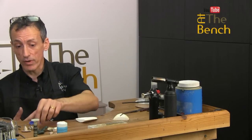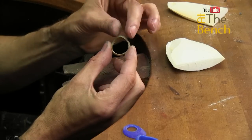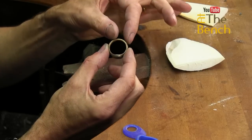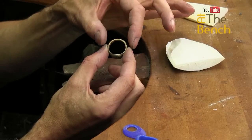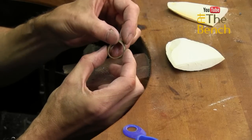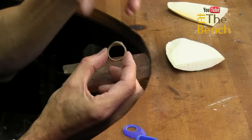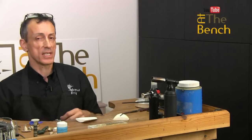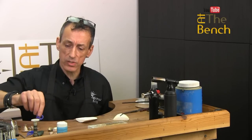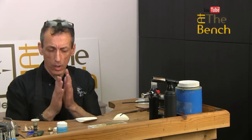In something like this arrowhead, we have the silver coming down from the top — the largest area — and then it fills the smallest area at the bottom. You don't want the silver coming into the narrowest point first. Likewise, if you were making a ring, this is the thickest area — not much point having it this way up trying to get silver down into a thin, narrow area. You would have the sprue and pouring channel at the head, the biggest thickest area, so the silver will travel and not solidify. We'll cover two-part moulds in later films.